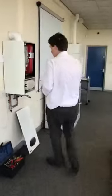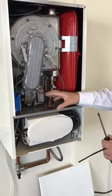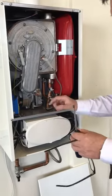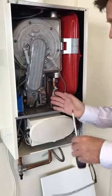Back to a pre-mix — this is clean. The air comes from exactly the same place as it does with an atmospheric boiler. The reason for it being clean — not to teach you to suck eggs — is that the air intake is working like a Dyson vac. It's sucking all that debris up into the burner.